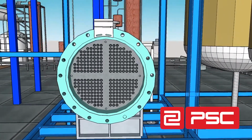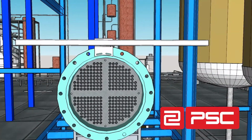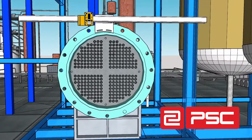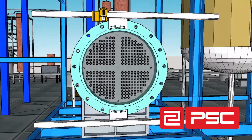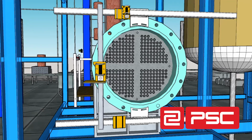Start with the top flange adapter installation. Next, install the top horizontal box rail and drive unit. Begin the bottom section of the frame setup with the bottom flange adapter. Install the bottom horizontal box rail and free roller. Finish off the frame by installing the vertical box rail and drive unit.